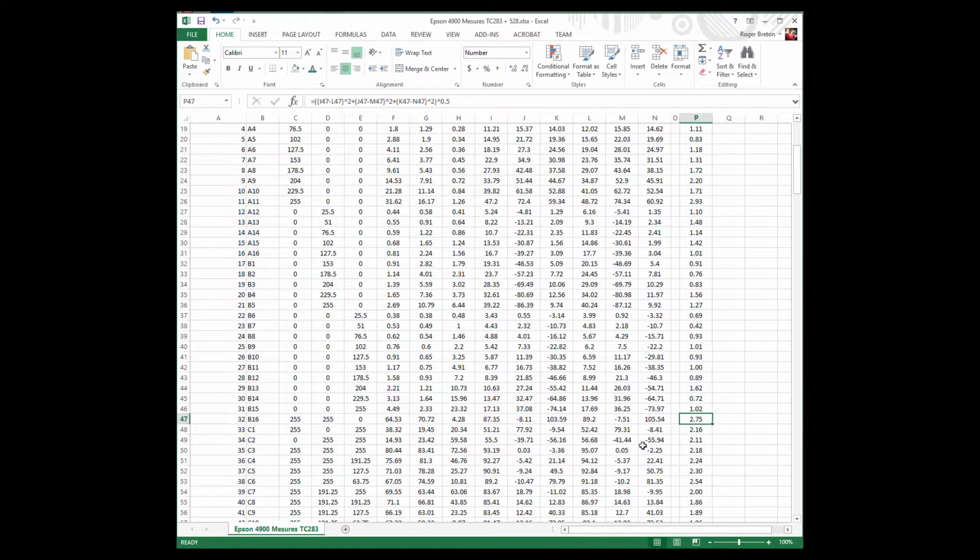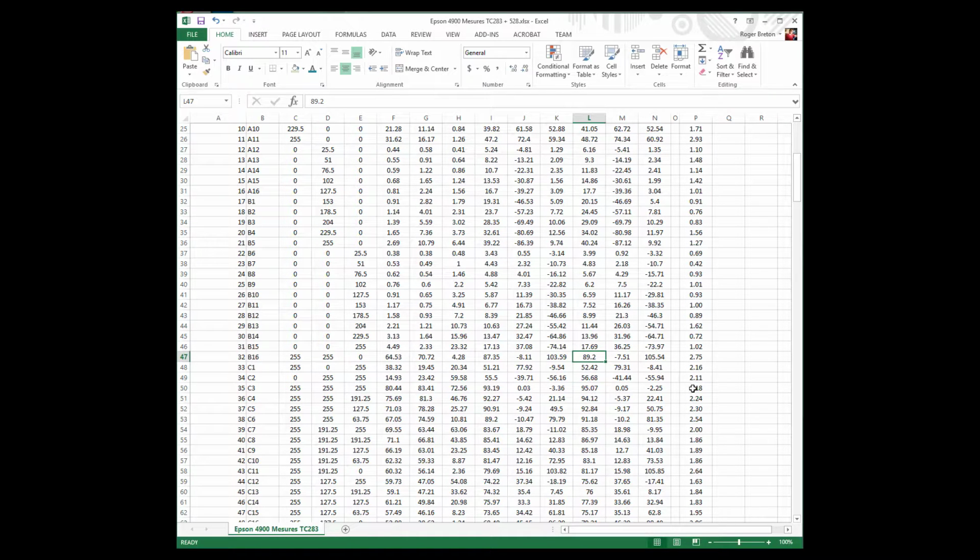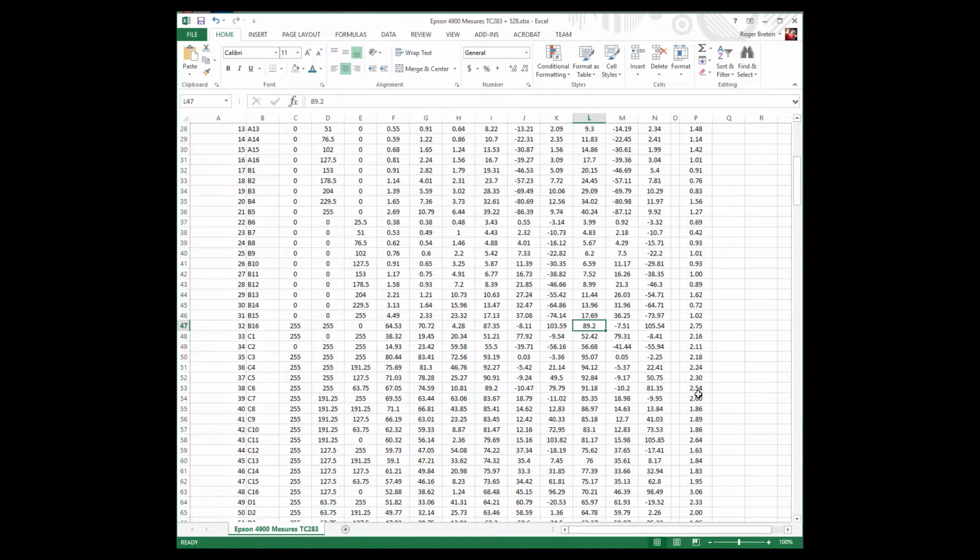Over here, the yellow. What do we say? The yellow is 87 versus 89. So with the 528, it could be that the white sheet that I was putting underneath influenced the difference. You see that? 87 and 89, because yellow is a very transparent ink, so it's influenced by the backing or the whiteness of the sheet underneath it. So it'd be worth redoing these measurements with a different kind of backing, just to be sure. A backing similar to what's under the DTP41. That's one hypothesis. So you see, these are high yellow contents, and they show a little higher color difference.